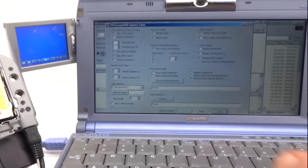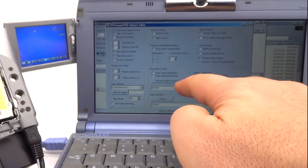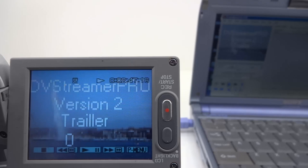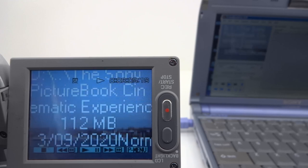We're still set for raw. No error correction redundancy. Let's start it and see what happens. Okay, well the backup is complete in just under 60 minutes. One reason I stored less data than expected is each file has a header and a trailer, equal to about 10 seconds each. With 37 files, that's over 6 minutes or 10% of the tape. I could have combined all the videos together into a single archive, but for this experiment I'm testing the limits of what DV tape can do.